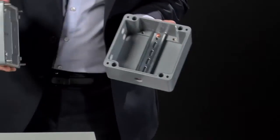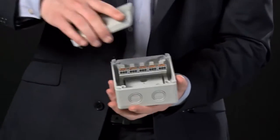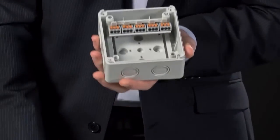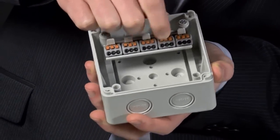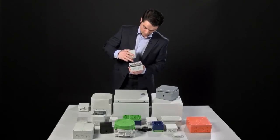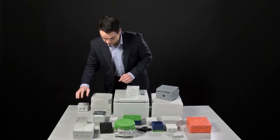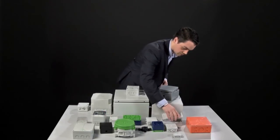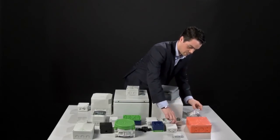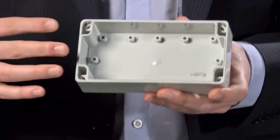Let's come back to this one quickly — we've got some DIN rail mounting here. Moving over to the A box, we can see some examples of terminals housed in here. Nice and smart, screwless connection — just pop your wire in there, slot this down, and that's your connection done. I've got a great example of how you could just house a little PCB with the different options which are available. Little mounting points within the enclosure which would just let you put exactly what you need.